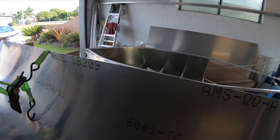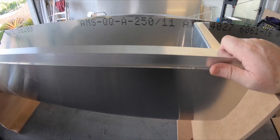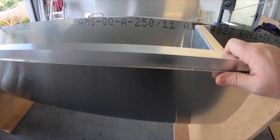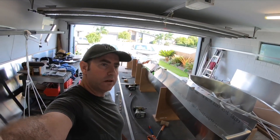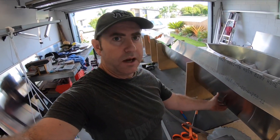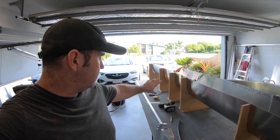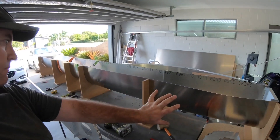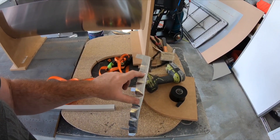These tubes here are actually going to drop in along the edges to keep the edges nice and square. A couple of reasons why I made this curve on the bottom section - obviously curves are a lot stronger. Once that's curved, that beam is actually super strong. It won't flex that way. So I'm going to take all my holes in this side of it.